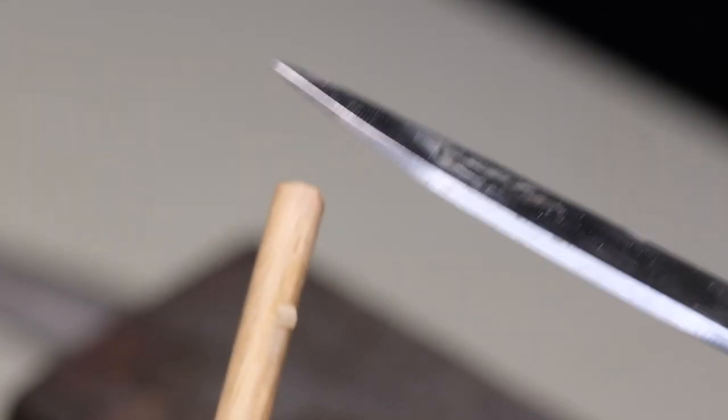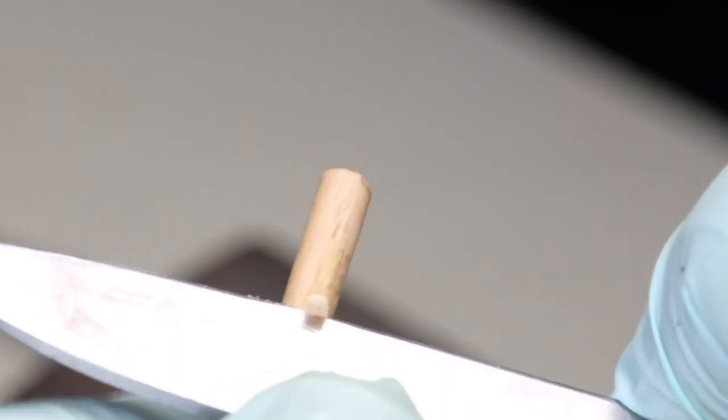And for cleaning out the bearing holes, I sharpen the other end of the wood to a kind of screwdriver or sort of chisel shape. Sometimes I'll use a bit of 4-0 steel wool in the oil sinks as well. They're the little depressions in which oil can sit around the bearings to make them extra clean.